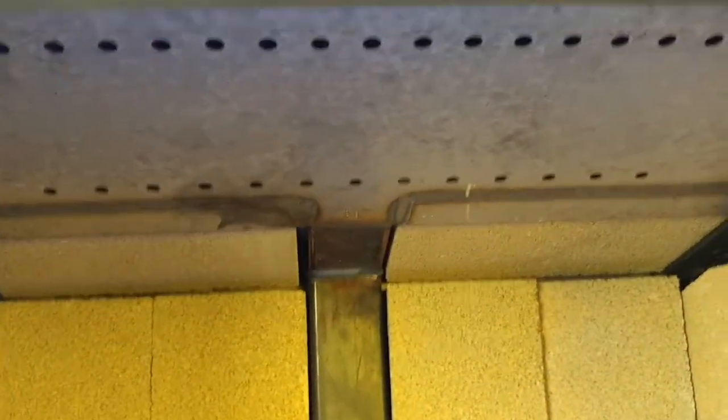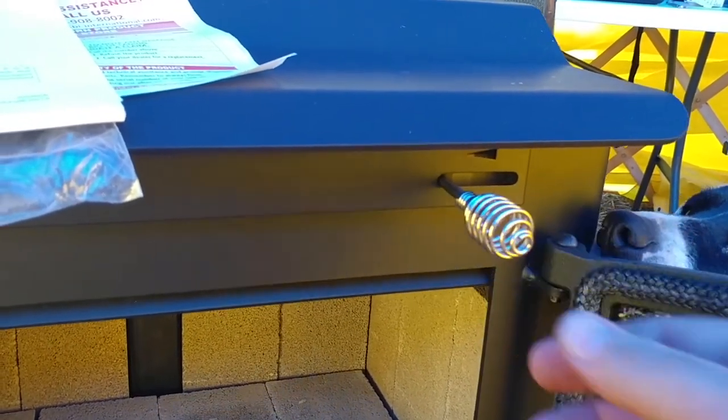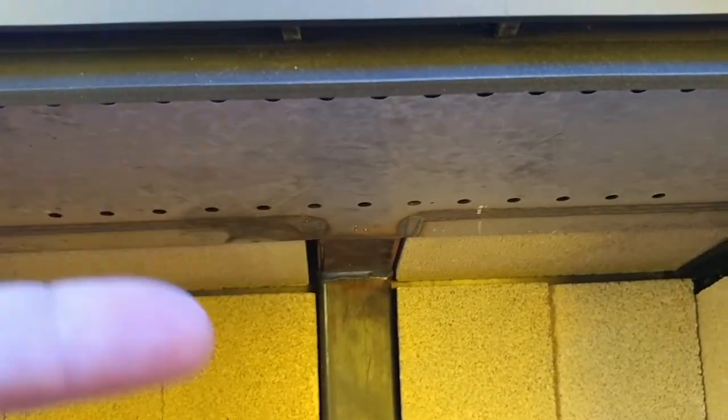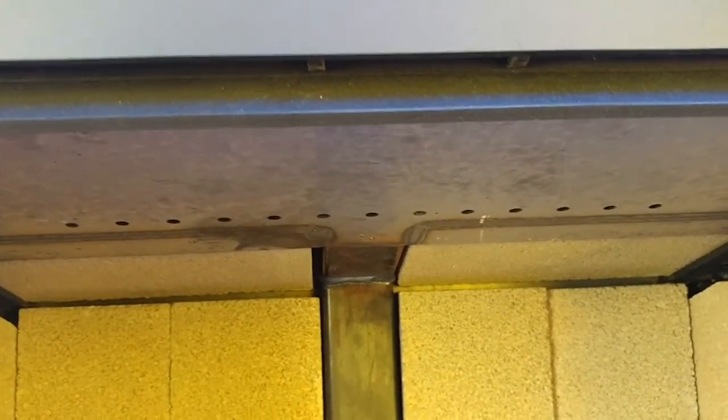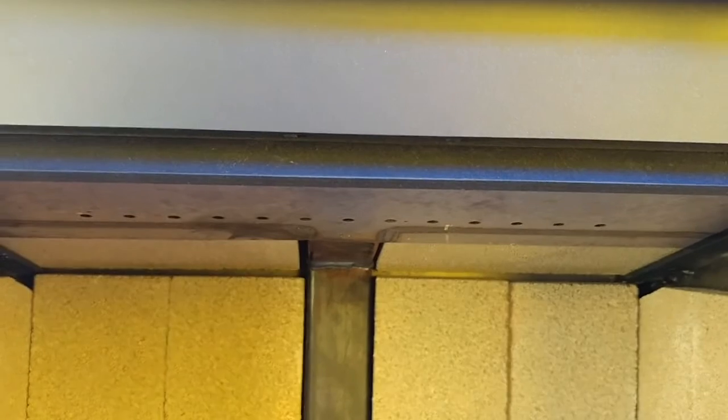It comes with everything - you just have to put on the little handles here and here, and that's basically it. It comes with the fire brick. This is one of those EPA stoves - I've never had one so I'm hoping I'm not disappointed. This is your air control right there - a little more air, a little less air. There's also a vent you can't plug up or block down there that takes air in, feeds it up through there and out of these holes. That's probably part of the EPA compliance - you can't totally smother it out.